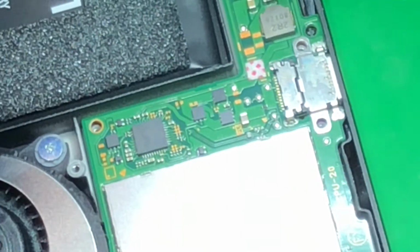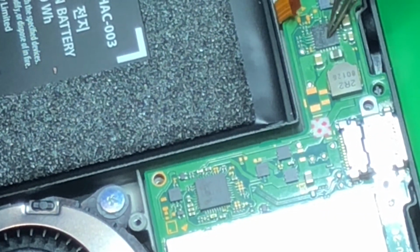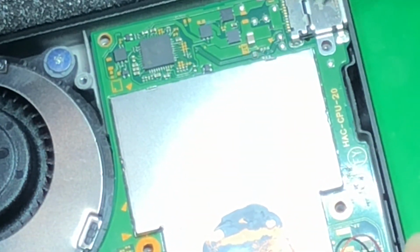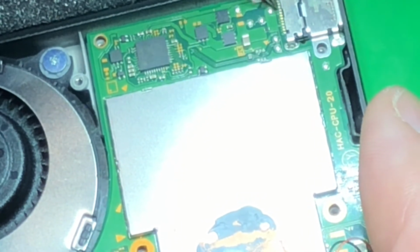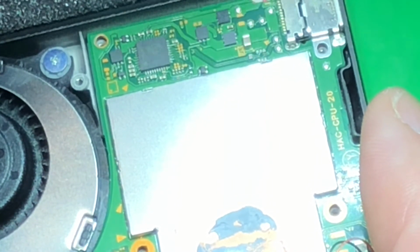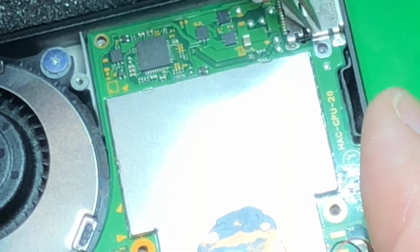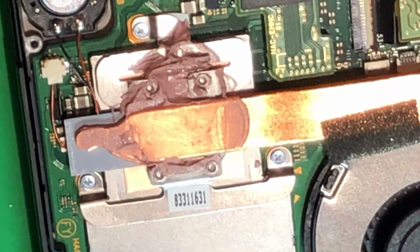But yeah, so on these switches, you're going to see some bricked ones. Usually it's going to be that chip I just changed a lot of times, or it's going to be this: there's a coil here that pops off. This gets cooked. Don't see this one die too often, but I have. These break a lot, and you see people try and change these on their own, and they just dig them up. So like you see these pins here, you can see on the inside in the middle is a whole other row you can't see. Changing these USB-C connectors on these Nintendos, these are not for beginners.